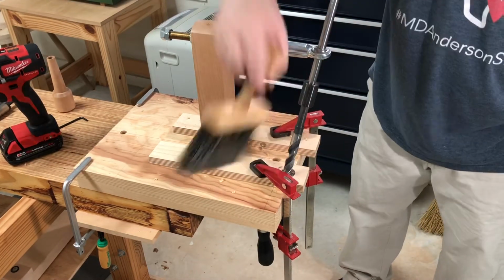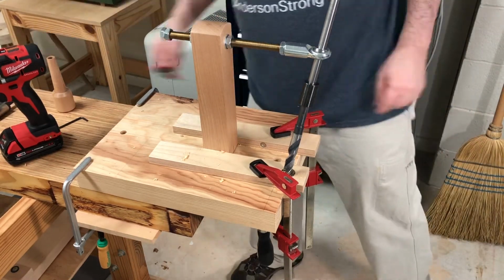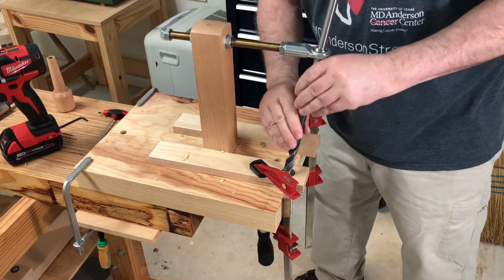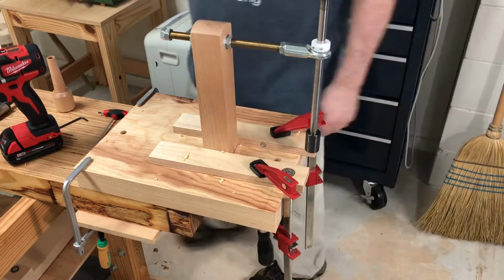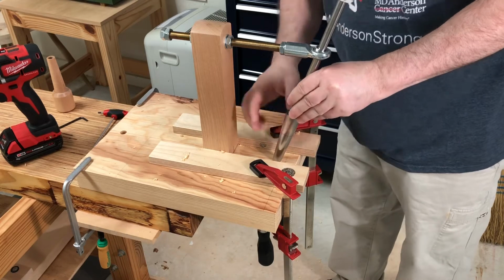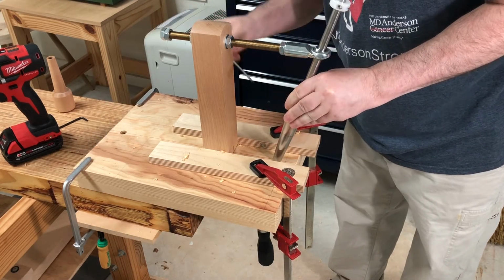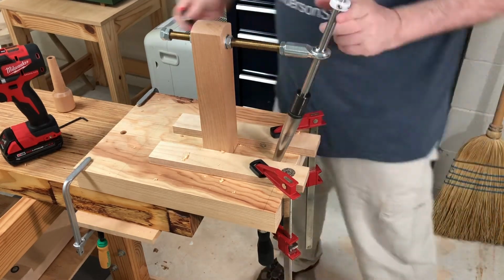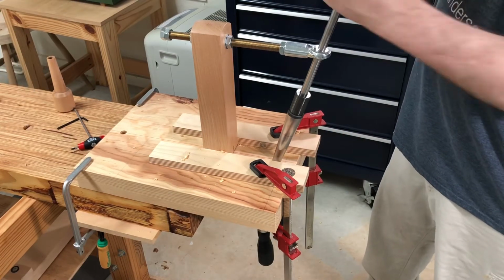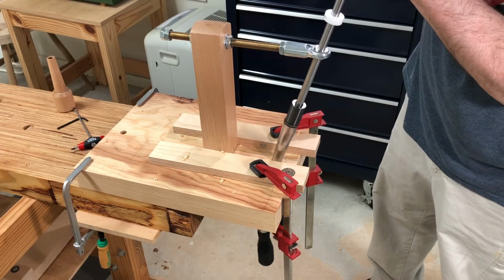We switch over to the actual reamer. And I did want to mention that Shawn Murphy's selling an actual coupler attachment and a kit, so that you can create your own wooden handle for this reamer. So if you want to do any hand reaming with it, like you might need to do for a back post, because back posts are really finicky and you've got to ream those in tandem. They're very, very slow. Well, slow speed, in this case, hand reaming.